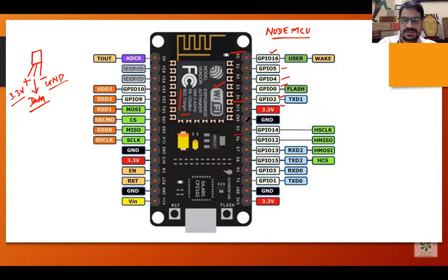After that we have D5, D6, D7, D8 — four more pins with internal names GPIO 14, 12, 13, and 15. Then we have RX and TX pins, which also work as General Purpose Input Output pins but are dedicated for serial input and output. TX is for data transmission and RX is for receiving data. For example, to connect a Bluetooth device, you would use the TX and RX pins.